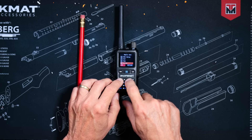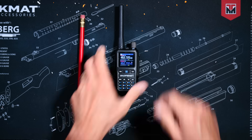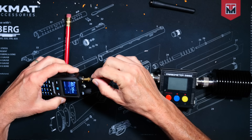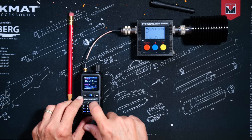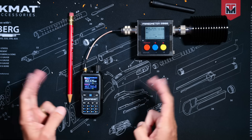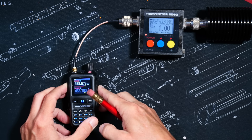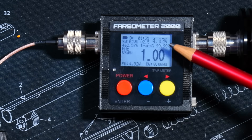And yes, of course, as with all high-end quality radios, this radio does have a Roger beep. Even though RF power output is not the most important factor in how far a radio gets — it's the antenna and your location that impact range more than the RF output — the user manual says this radio outputs 5 watts of RF electricity. Because some people think it actually matters, I will test it anyway. And as you can see with your very own eyes, on GMRS channel 16, this radio is outputting just slightly under 5 watts of RF electricity.